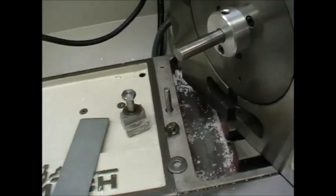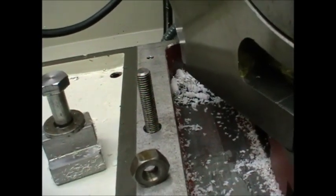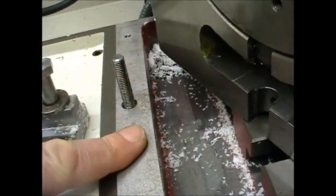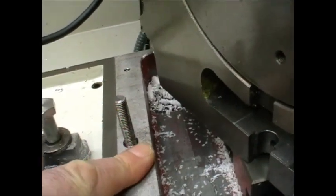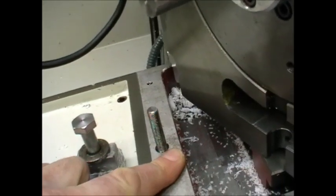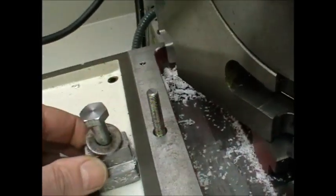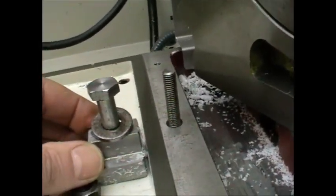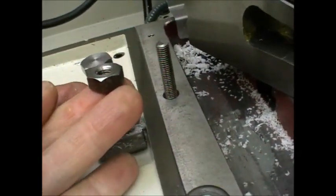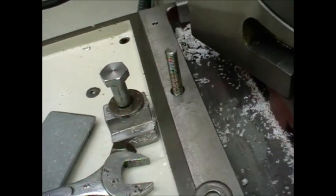Just to review that first clip — the thread I used is 8mm, which is more like a 5/16 in imperial, because I really didn't want to weaken this section of cast iron. But that's enough, because you don't need great force to grip the base plate of a 4th axis or vice down — you're gripping over a big area. I cut the nut the same size across the flat so I can use the same spanner and quickly tighten it up in place.